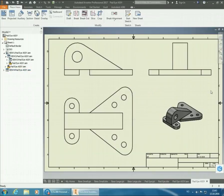So then whoever is going to weld these parts together is going to have an easy job of seeing how the finished product is supposed to look. And now we need to start adding information for the welder. What are the dimensions and everything, and how are the welds going to look? So the most important thing that our welder needs to know is the gap between the bases. So he needs to know the dimension that we put in there, the 24.3 millimeters.